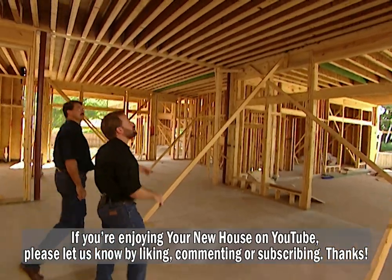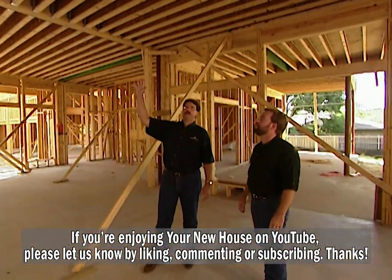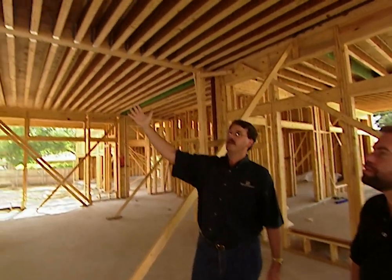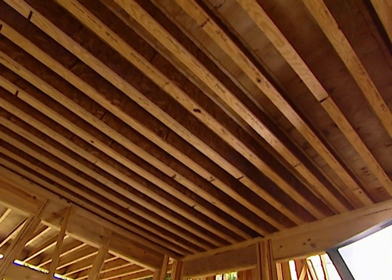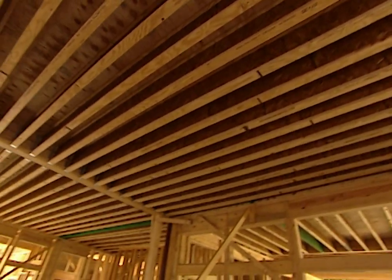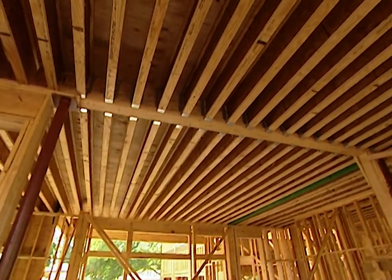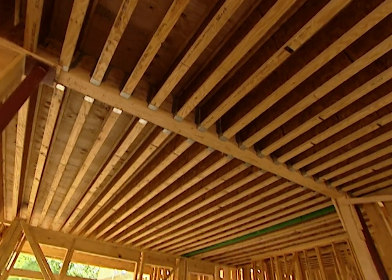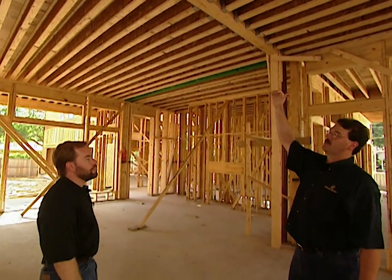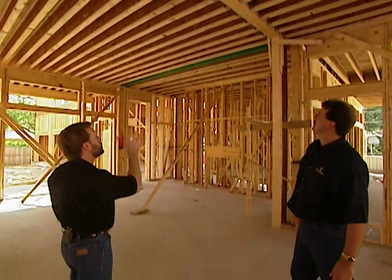We have a huge room here and the I-joists run all the way across to support the weight from upstairs. This is a great example of the advantages of the I-joist engineered wood flooring system — we've got about a 20–26 foot span in here, which just wouldn't be possible with solid wood 2x10 or 2x12; we'd have to have posts or columns. Now we have a great big open room. To support that weight, there's a giant glulam on the end going across this wall. As good as the I-joist system is, we can't span 40–50 feet, so the glulam breaks the span. It's manufactured to the same depth as the I-joist so we have a smooth ceiling all the way across.